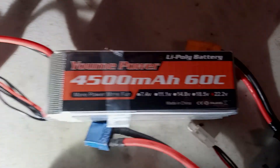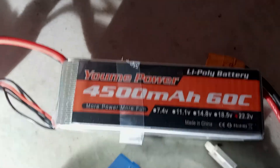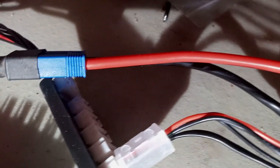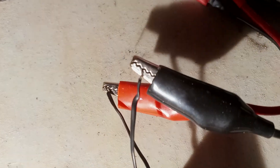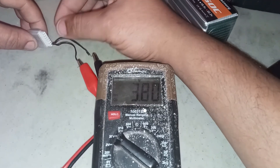She's charging. The reason I'm at one amp is because these are 4500 milliamp-hour LiPos. That 4500mAh rating is meant for those thick wires, so I'm charging at one amp because we're going through these small wires — especially these bread ties, which are not made to conduct electricity, so I don't want to stress those out.